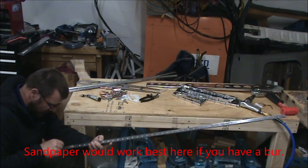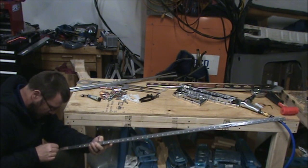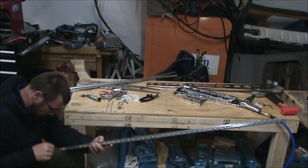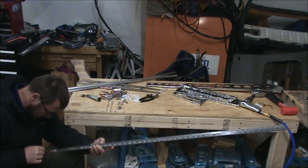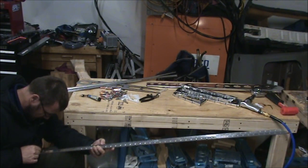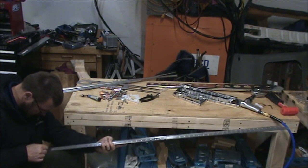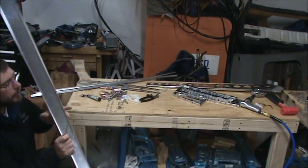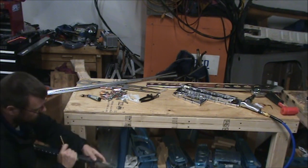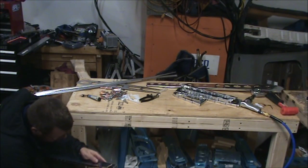And pretty much at the speed that countersink's spinning, and how it cuts, it's probably not leaving all that much of a burr anyway, compared to a drill bit. Or at least that's what it appears on this piece. Maybe if the countersink wasn't deep going into the spar cap, it would be creating more of a burr on the backside edge where it didn't cut through versus this one.